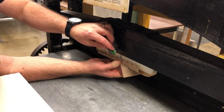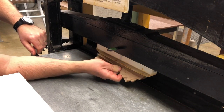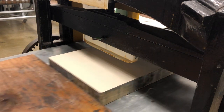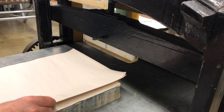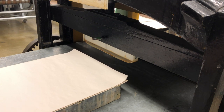Here's another view. In this one I've got a piece of paper towel holding the bottom because it's kind of greasy — it saves me having to clean my hands every time. Being careful to ensure that none of that grease ends up on my stone, I can roll the bed and the stone underneath the scraper bar to ensure that left to right I'm relatively lined up. Next, before we do any fun transfer stuff, we have to set the pressure.